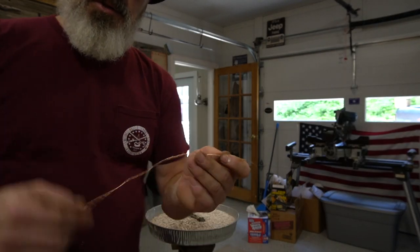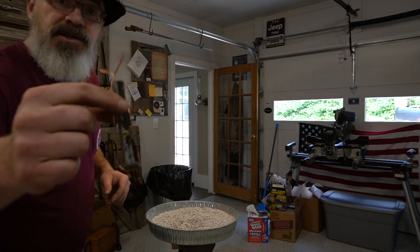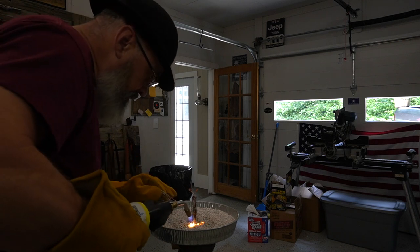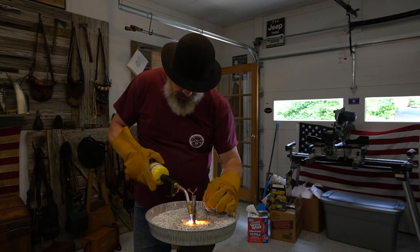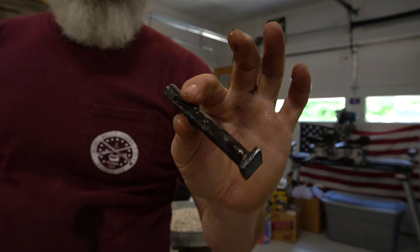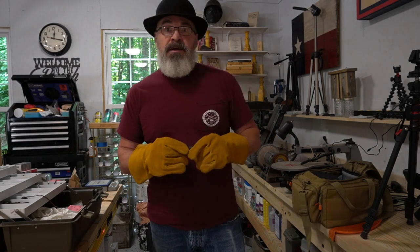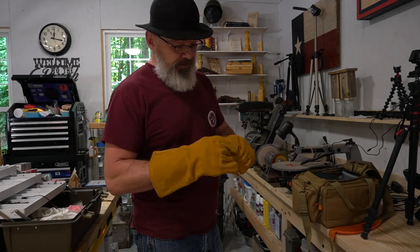Red hot — our tip is silver soldered on. Now we'll get over and grind this thing down. To grind it down it's going to get hot, so you want some water to quench it as you're using the belt sander. I kind of grind a little bit, it starts to get hot, quench it, grind a little bit, and quench it. Basically what we're doing is just taking this down from square to round, and we want to make it fit the body of the tip itself. You can do that with a hacksaw — you can cut it down lots of different ways — I just use a belt sander.